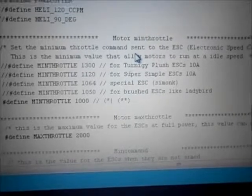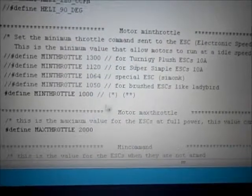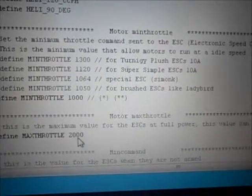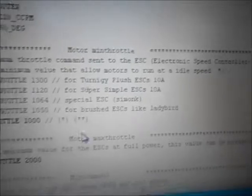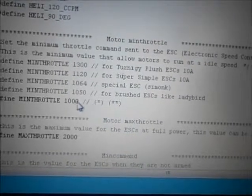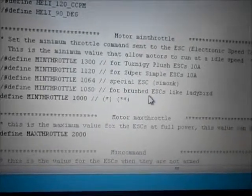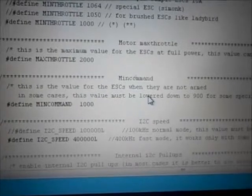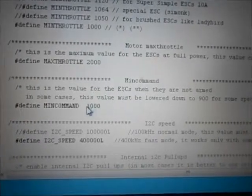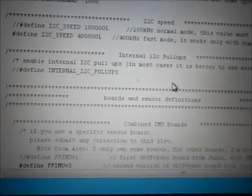With my GUI nothing was lining up right - with minimum throttle and max throttle it wanted 1000 min and 2000 max, so that's what I gave it. Comes out when everything is centered it's 1500 like it should be. They gave you some crazy settings in here but you're allowed to change that. I just define min throttle at 1000, define max throttle at 2000, and everything seems to be working out. Min command, same thing - make it 1000. This was 950 or something and nothing seemed to want to work like that. I just screwed around with it until I finally got a setting that made it work.